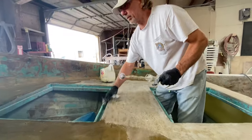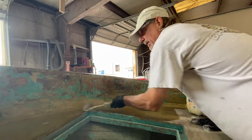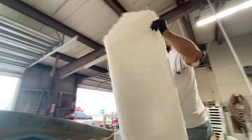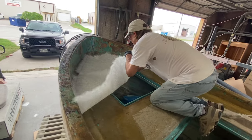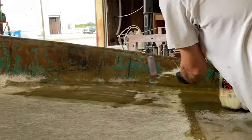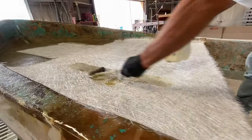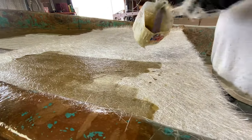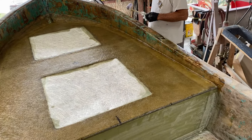I'm going to go to here and then do all of this in a little while with smaller pieces. Right now I want to get all this one-layer tie-in done — that way I don't have to sand it. Here Keith is getting that new sheet of glass to be laid over the deck. He finished doing the gunnels, pre-cut the glass, getting it fitted to the bow. Check out the process of him rolling this deck out, sealing that new layer of glass over the bow. I've never seen this done before in person, so to watch it was really cool. Everything came together very nicely — the boat looks super uniform and I'm starting to see how good this boat is going to look when it's done.